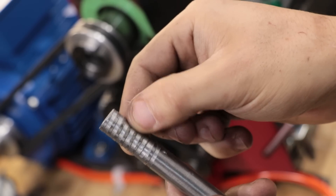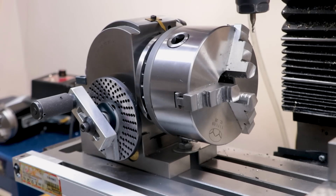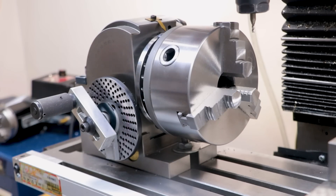However, I'm not going to give up, though I will need a new approach. I eventually landed on the idea of cutting the thread with the milling machine by using helical milling. It would be a lot easier if I had a CNC machine, but I can definitely do it on the manual mill. The aim will be to connect the dividing head to the mill's lead screw so that it rotates as I move the mill's table.